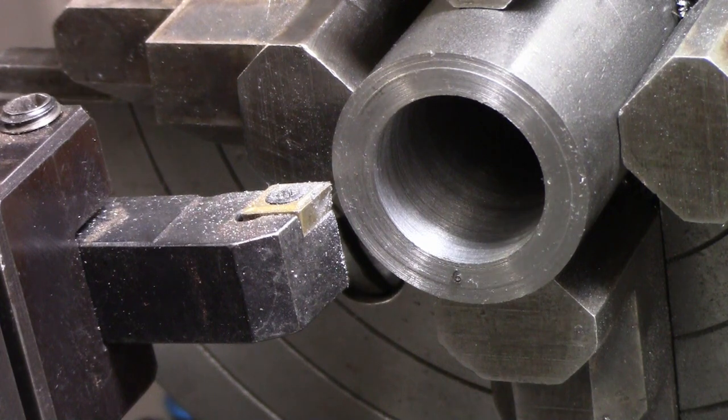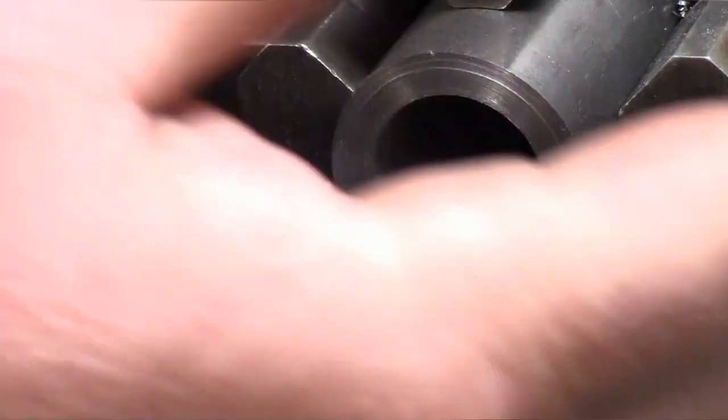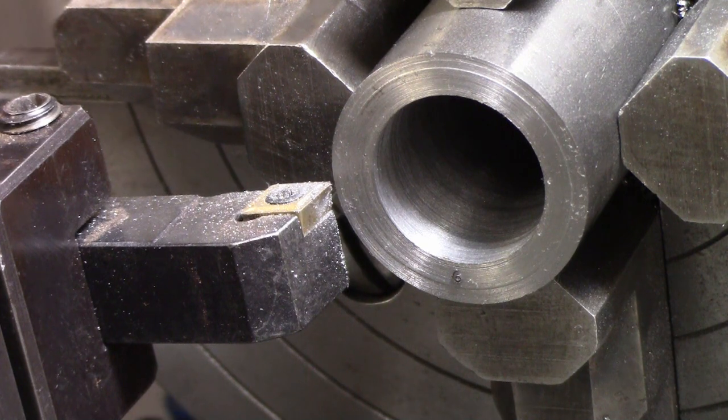Alright, so on the outboard of the spindle, which I'll show you, there's a 60 degree shallow taper on that. So we're going to put that on this piece here. So we're set up to do that right now. So I'm going to slow this machine down. The cross slide ends up being pretty close to the chuck, but I think we can get away with it.